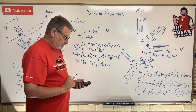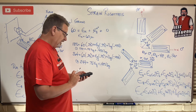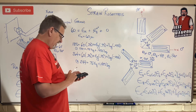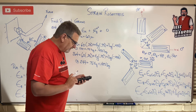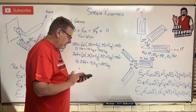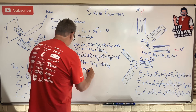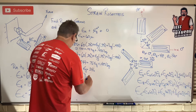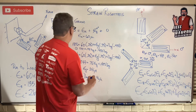Let's put that into the system solver — two-by-two. First equation: 0.75, 0.433, constant 120. Second equation: 0.75, −0.433, constant 249. Solve. The calculator gives us strain_y = 246 micro and gamma_xy = −148.96 micro.